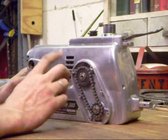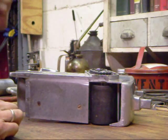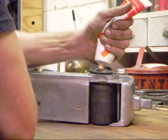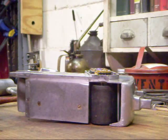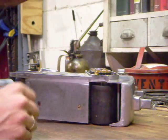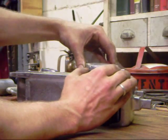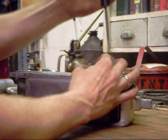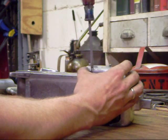Next, we're going to grease the chain and install the cover. The easiest way is to lay the sander on its side for the cable grease. You don't have to fill the cavity up — the chain will distribute it. I usually concern myself with filling the space between the two sprockets; that's a pretty good indication of how much grease you actually need. It's a good idea to check it every so often, but there's really no place for the grease to go and not a whole lot is required. Then we install the old gasket and our cover. The 503 does not use a spring clip like the 504 to put tension on the chain, but it's very rare for that chain to come off, so it's not a concern — it's just how the designers built this.